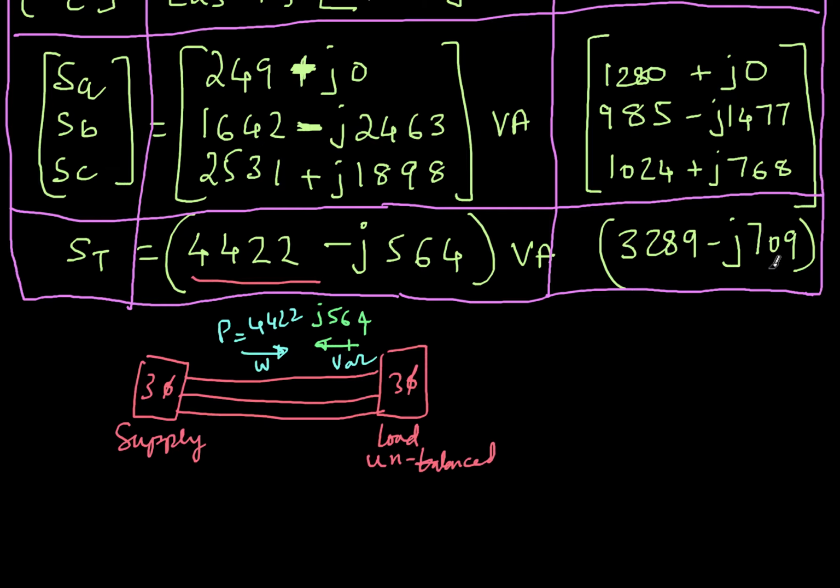And similarly here, not only is a three-phase three-wire system increasing the active power, it is reducing the reverse flow of the reactive power. You can see it here. By the way, these numbers are not always true. Depending on the characteristics of the load, sometimes this may be less than this. So I'm not saying this is always true, but in this case, it happens to be like this. Okay, that's the summary of the previous two videos.